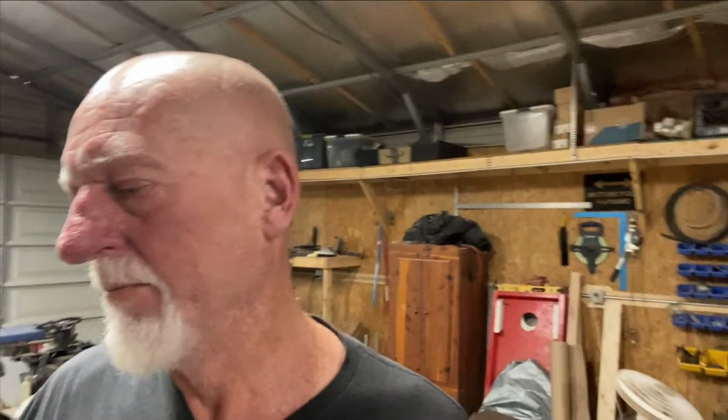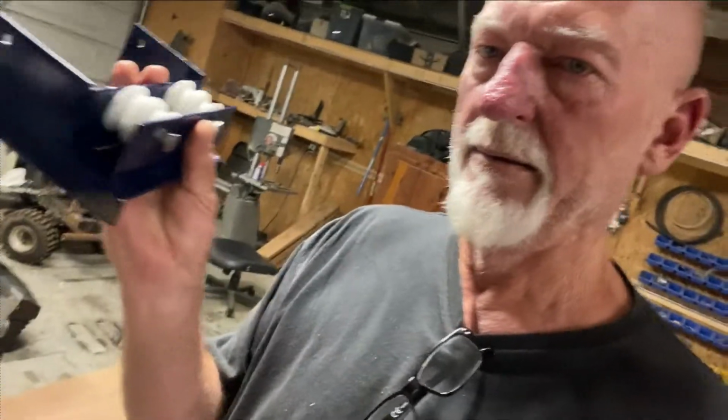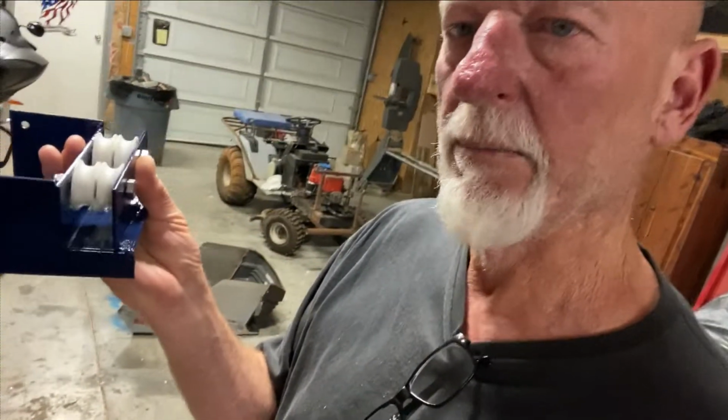So I did some measuring and stuff, and I'm gonna use that half inch or 3/4 inch oak to mount a pulley system on it that I came up with on the back of it, and the halyards will come down through this block and go to either side of the, just like they do now, but it'll be mounted onto the beam instead of that hard top. So all that'll be separate.